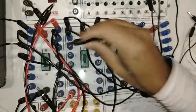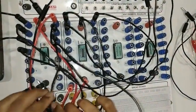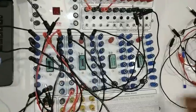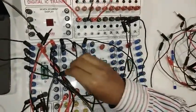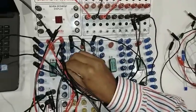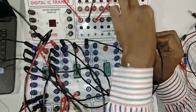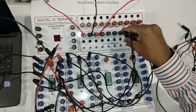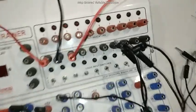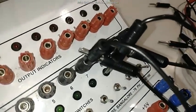D6 is connected to pin number 13, and D6 is 0, so pin number 13 is connected to ground. Next, D7 is connected to pin number 12, and D7 is D, so I short D to pin number 12 as well. All 8 inputs are now connected to their respective pins.